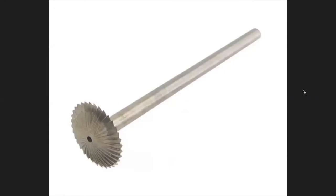This is a knife edge burr — it has a very sharp little edge on it but it fans out. Some have little saw teeth and some are plain. This one does the cutting even on the other surfaces so you can lay it down a little bit. I use this one for carving; it's also good for grinding stone seats or scoring on sheet metal.